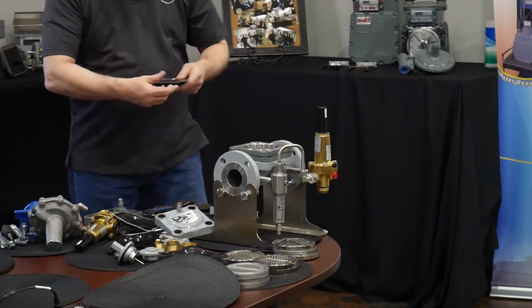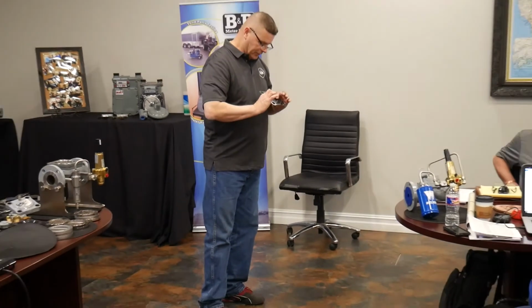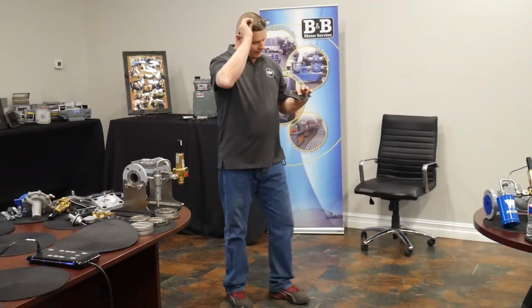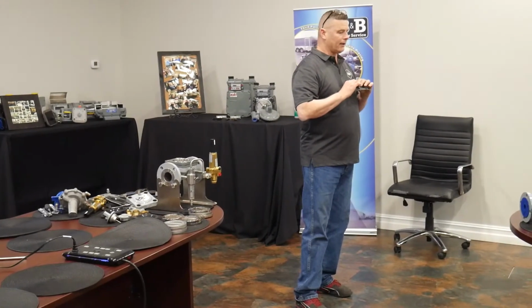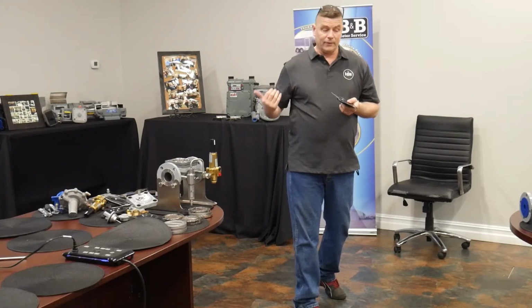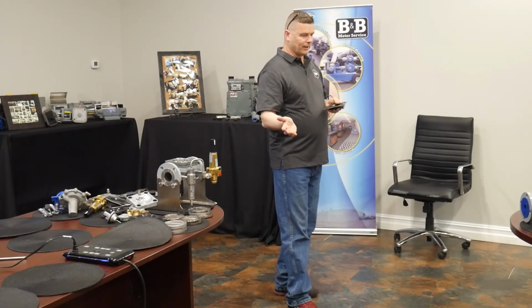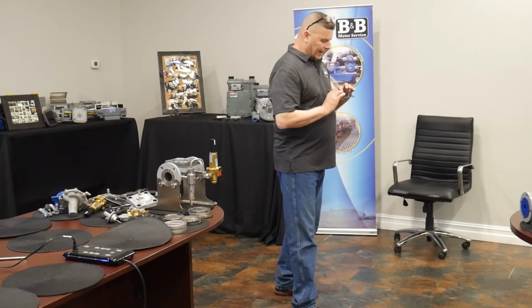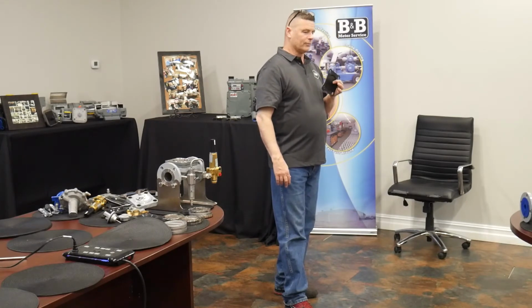Then my standard port diaphragm. And by the way, when I pass this around, notice that it'll say 60N on it here, and it says 14 in G. What this information is telling us is this is a 60 durometer nitrile diaphragm, which is very soft and flexible, good for low differential. When I say that for a flow grid, we're talking about under 60 pounds of pressure cut down to that 20 where I said we're not speccing it. That's the world that the 60 Duro would live in. And 14 is the year it was made. 2014 was the year that it was manufactured.